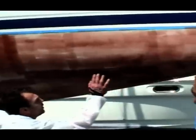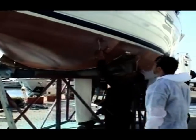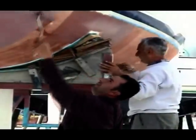With the starting point already looking cured but feeling slightly tacky to the touch, especially noticeable at the thickest areas, the second coat can be applied. Never delay unnecessarily between coats. As can be seen, freshly mixed and applied Coppercoat appears slightly pink in colour. As the coating cures and the moisture is driven from the resin emulsion, Coppercoat dries to a more natural copper brown colour. Consequently, it's easy to see where you're going as you pass down the hull methodically with this second coat.